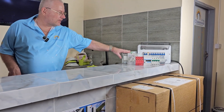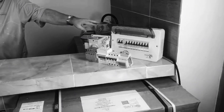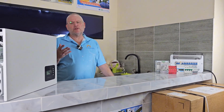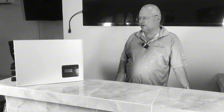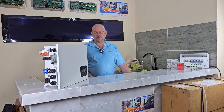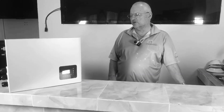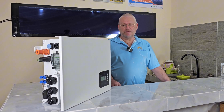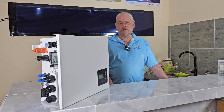Another part of the installation is the ATS that we have here, and also, in most cases, a UPS panel — a separate panel. So all these things make the installation, even though it's not very complicated, but it's complicated for somebody who doesn't have experience and good electrical understanding. There's a lot of mistakes that can be done. That creates a lot of problems for customers, which is why in most countries now, only certified installers can install — because that creates a much better user experience. With hybrid systems, that is even more important than with on-grid systems because of the complexity and added equipment.